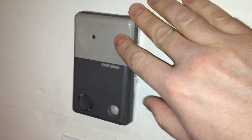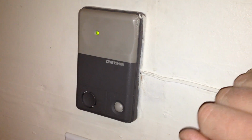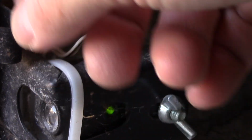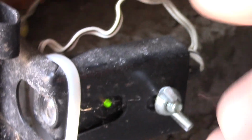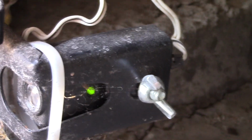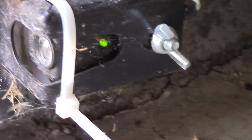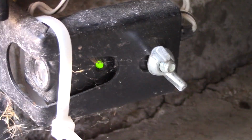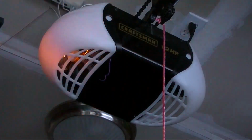Assuming yes, when you push the main button to open the garage door, do the lights blink or do they come on at all? If they blink, is there anything blocking the path of the door, assuming it's open? Maybe some cobwebs or spider webs, or are the sensors misaligned? Most sensors have an indicator light that tells you if they're working and the path is clear. If it's not clear, your garage door lights should blink when you try and close it.